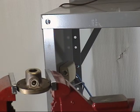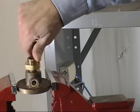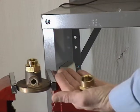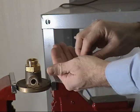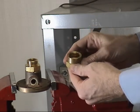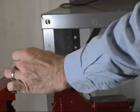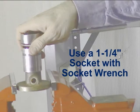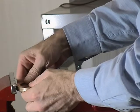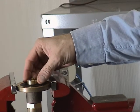To install the new parts provided in the repair kit, begin by installing the new housing assembly into the body. While holding the filter cap, insert the new filter and the new filter seal into the filter cap. Install the filter cap onto the body assembly and tighten with the socket. Rotate the air maintenance device back to the upright position. Place the new diaphragm assembly into the body and set the spring retainer in the center of the diaphragm assembly.